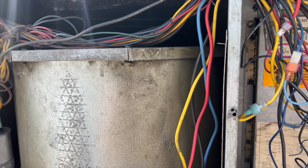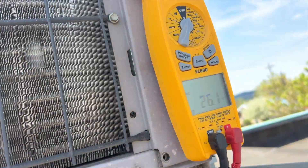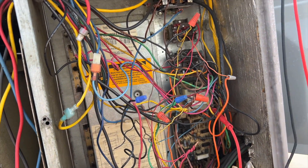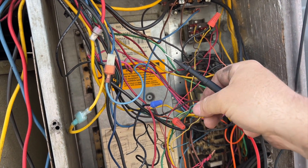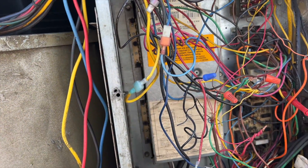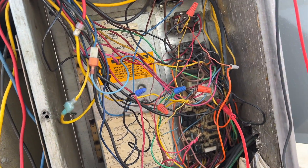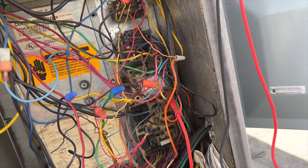G is not the problem. Now we've got 24 volts. I have nothing on Y yet, and that's because the thermostat — now that it's detecting power — is probably on anti-recycle. I'm just making sure I'm getting a call for G. I have a feeling we have some kind of short on the Y, because there are like 20 billion things hooked to it.